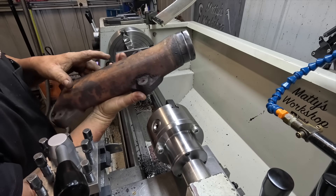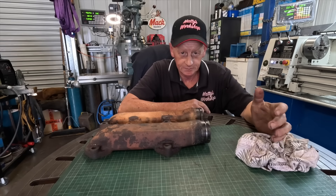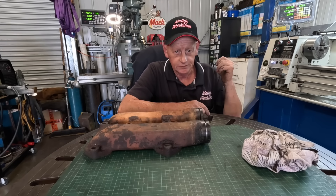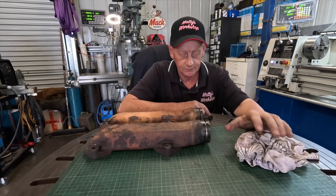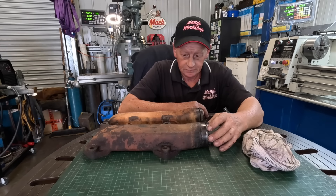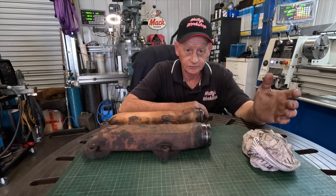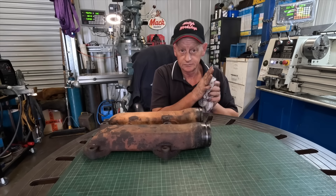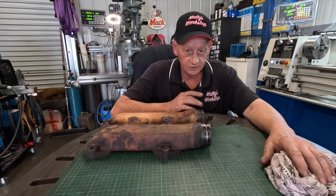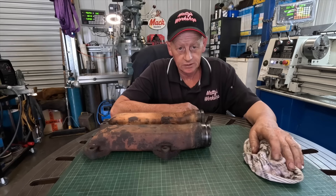There we have one manifold ready to go back on. I am super excited that setup worked. It's a bit of a shame I couldn't do it under power and just had to spin the chuck by hand, but being cast iron it wasn't too bad — it was only them couple of hard spots. It's got me thinking whether I convert that lathe to a three-phase motor and put a VFD on it so I can wind it right down for doing stuff like this. So this can go back to him now and back on the restoration — we don't have to worry about sourcing another one, and it's got all its original working parts back on it that it was using when the truck was retired. Hopefully you enjoyed that. Thanks for watching guys, see yous on the next one — hooroo!